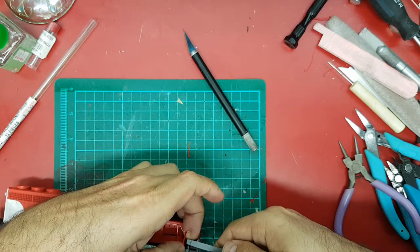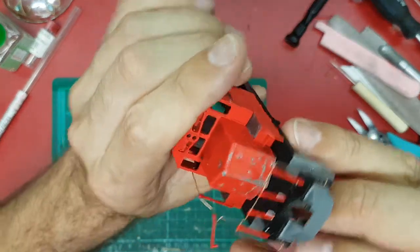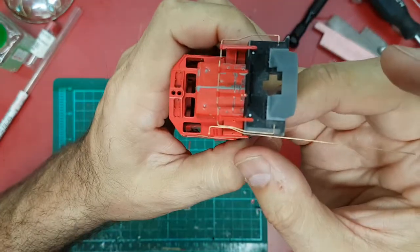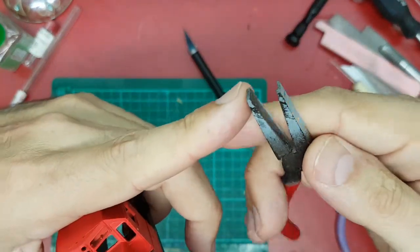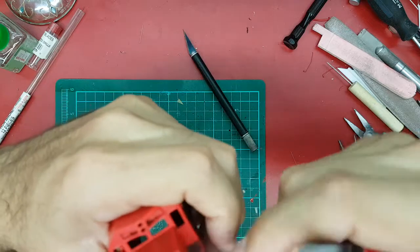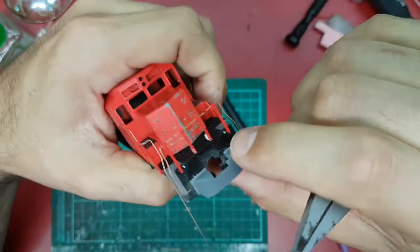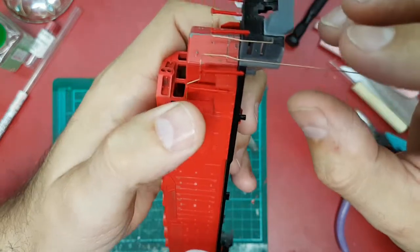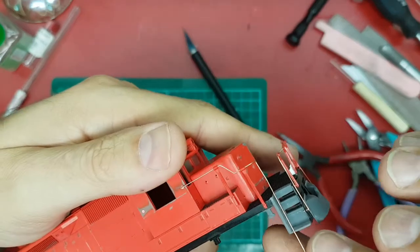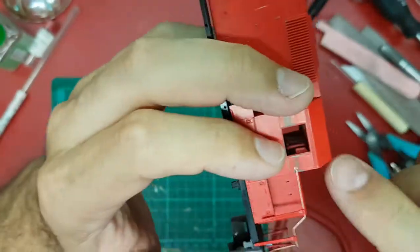I can go bend, bend. Just like that. We've got the matching bend at the front. So what I got is a pair of pliers here. And if you can find a flat pair that matches this bend here, then it's a matter of just grabbing the wire at the right spot, doing a bend, reverse bend, and then you're golden. So you notice it's not going straight down, so we're going to adjust that right now. We want it to be going straight down.